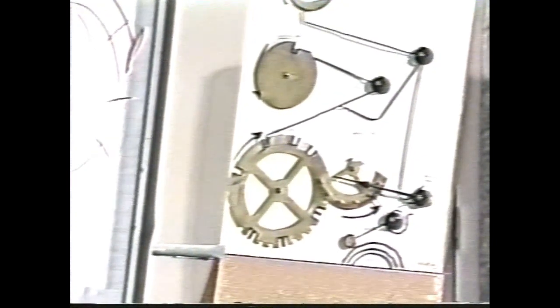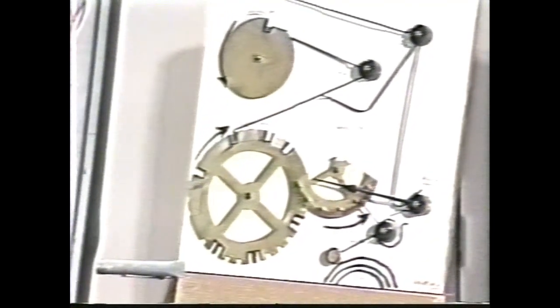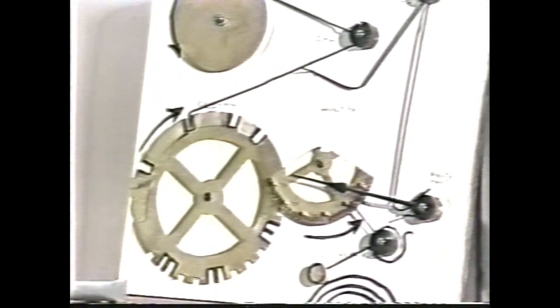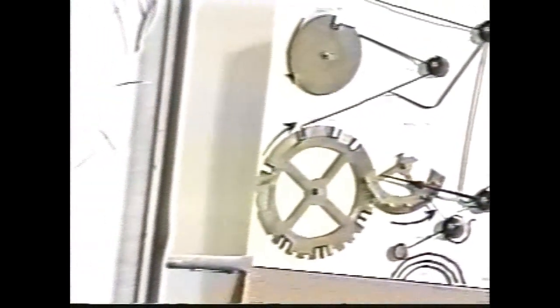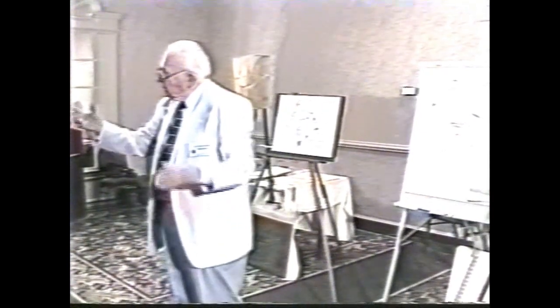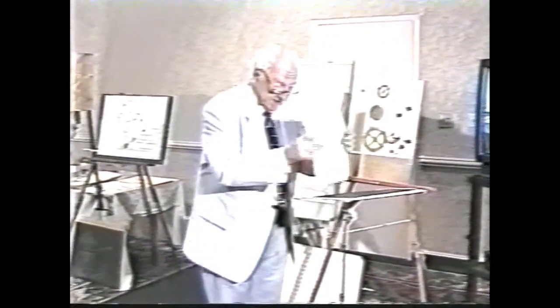I'll tell you why I mentioned it, and this is where I'm getting to what I've been talking about. Every French count wheel striking clock you will ever see, forever, has the short unlocking arm not on the unlocking warning assembly, but on the counting locking assembly. Every one. I surely don't know any exceptions. Now, isn't that strange? I'm talking about American count wheel striking, and here is one of the simple variations. And I'm also explaining how French count wheel striking works. This is why I consider it one of the variations. I never forget to mention it, and I'm always tickled to say that every French count wheel striking clock will have that minor variation, every one.